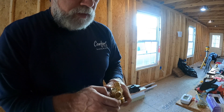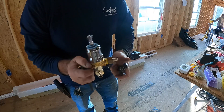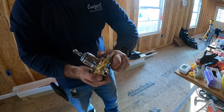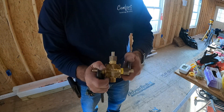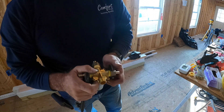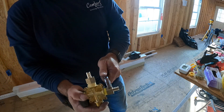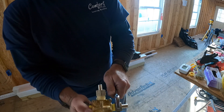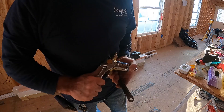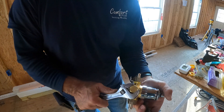We'll just get all these things Tefloned up, screw those adapters on, and start tightening them up. Got plenty of tape on it - tighten these guys up good. After I get done handling it, I'll probably go ahead and wrap Teflon on this bottom port that I'm going to cap, because it'll be hard to wrap it on there when it's already attached to the tub. Probably should just use another one of these female fittings and crimp on a short piece of PEX and a plug, but I think I'd rather have a cap. Found a cap in my 20-year-old box of piping.